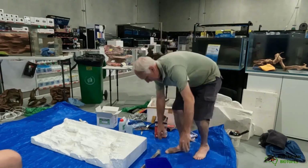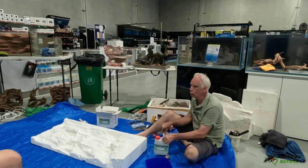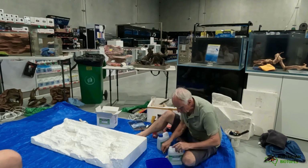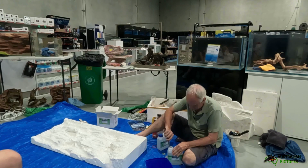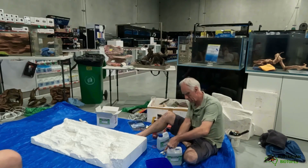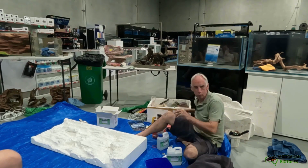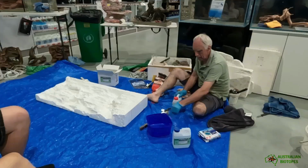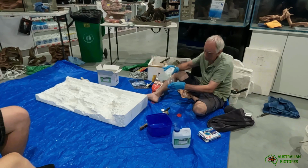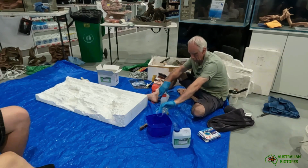Let's get started. So as I said, with fiberglass resin, you can make a hot mix. With this resin, you cannot make a hot mix. You've got to stick to 1 to 2. Okay? Man, they got really fancy because they didn't have any of this on it. Can't play with that either? No, that's not a tool either, a toy apparently. Number one rule, don't get on yourself. Well, not anymore. The number one rule, use gloves. And you always put the red in first. I don't know why, but the chemist said that's how you do it. So that's B, right? Yep. So 1B, 2A. That's correct.